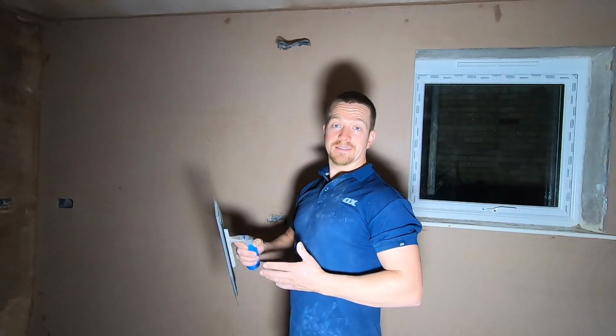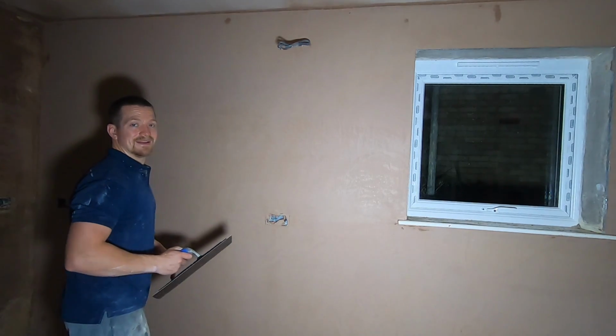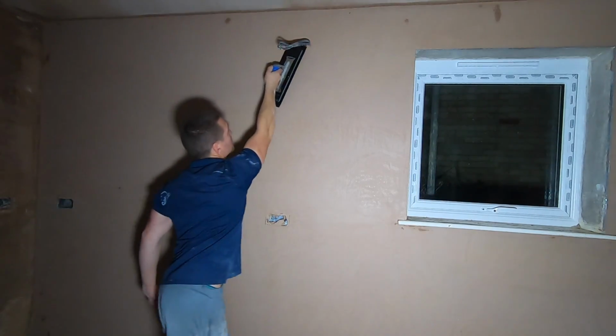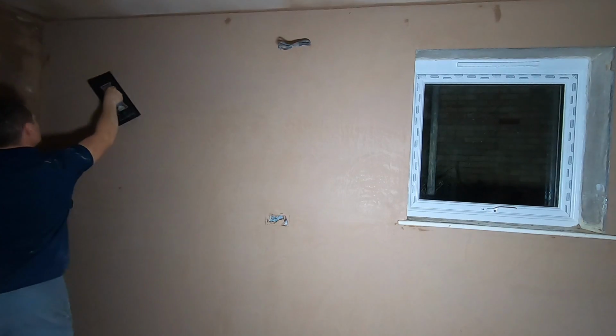the job. This is a dry trowel. That's because we're going dry. They were very creative, these plasterers, with the names, weren't they? It goes as high as you can. One more cross trowel, working from one end to another, and back on yourself.